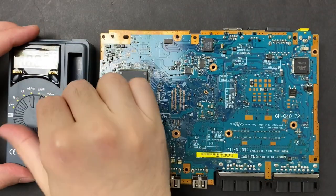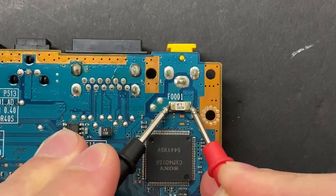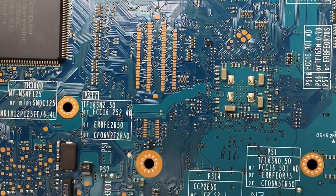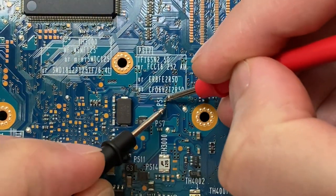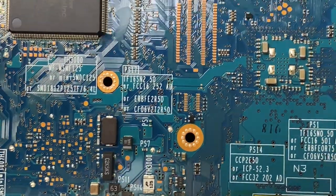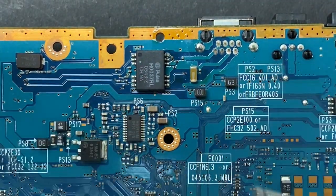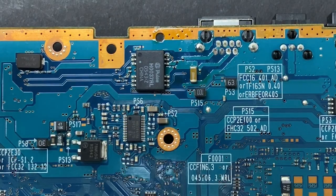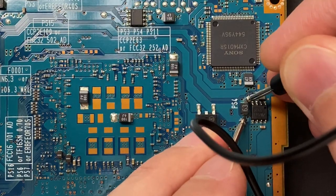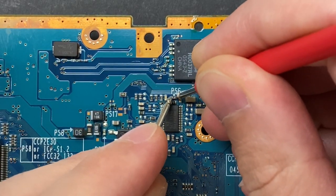The multimeter is in continuity mode and I'm going to go through the fuses in alphabetical order. This is the main power fuse — if your unit wasn't turning on, that would be the one to check. A bunch of these fuses are clustered together; for example, you can see one and seven right next to each other. But for the sake of being thorough, I like going in alphabetical order so I'm sure I don't forget to check one by mistake. You can always check the service manual to see what each fuse is responsible for.